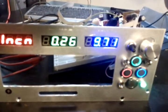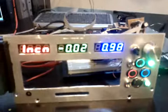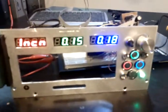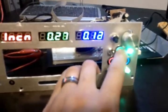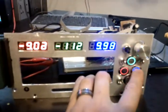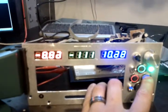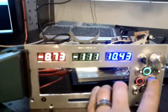All of this is driven off a real-time scheduler that's being serviced by a single interrupt from the Teensy. Performance is pretty good — a full display refresh costs about 60 microseconds, based on the delay loop I put in. The accelerometer output is rebased to zero: rather than being unsigned, I've made it signed.